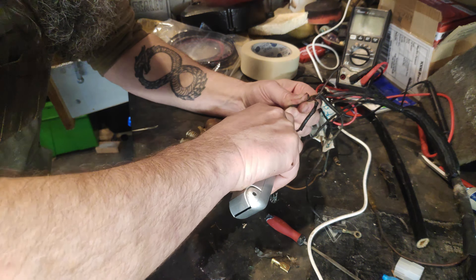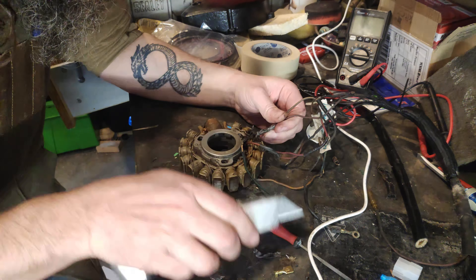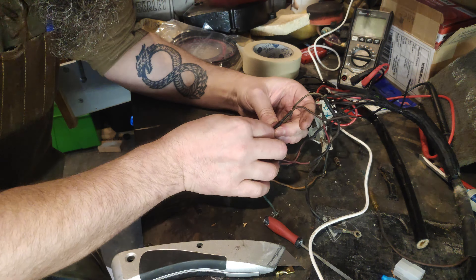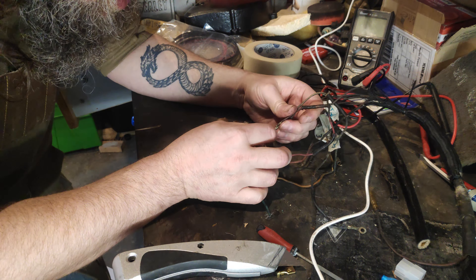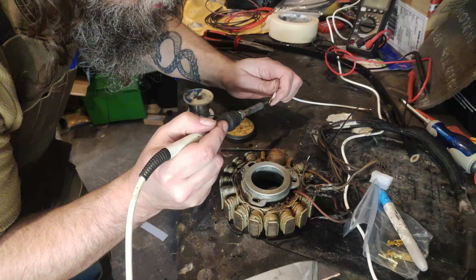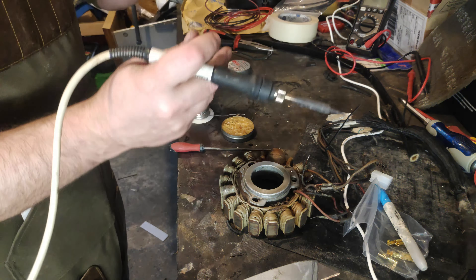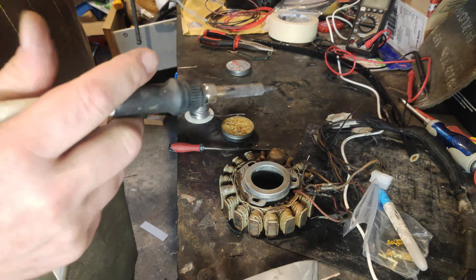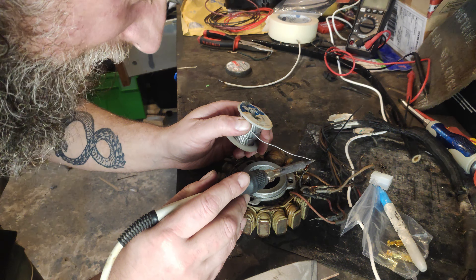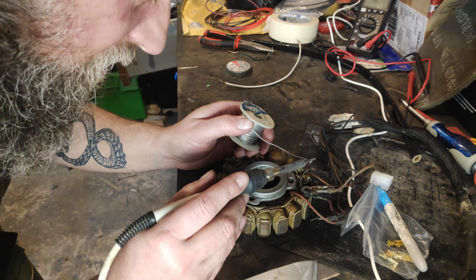This is definitely the damaged one, and the new wire I'm going to put in here is slightly more resistant, shall we say. Oh, the state of it — crispy now. Of course they're enameled wires, so the solder is only going to grip to the top bit.